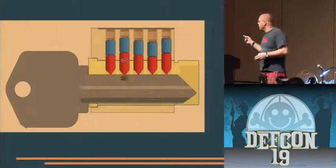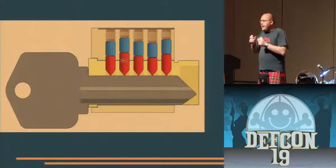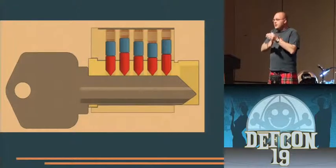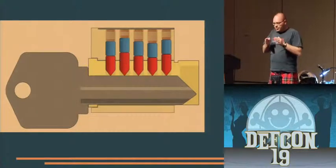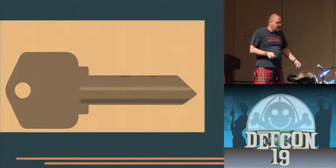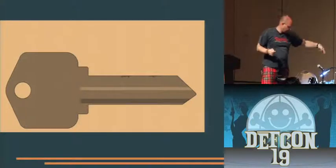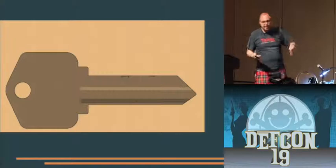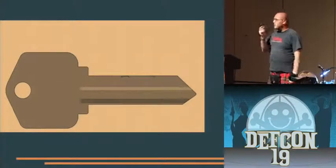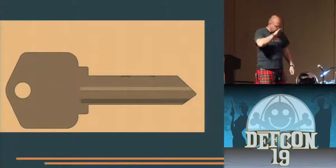And the other two, so now it's pin 2 and now it's pin 4, they get stuck. So if you put a key under it and apply some force, you're pushing at a point. Now, if you take it out and examine it very closely, with a microscope or magnifier, special lights or normal light, then if you're lucky, you might see little scratches, dents, impressioning marks on that blank.